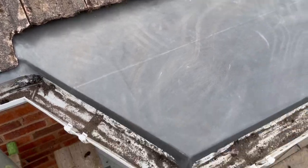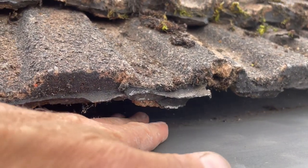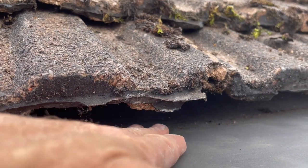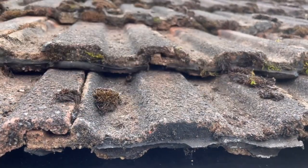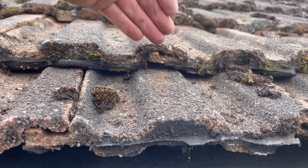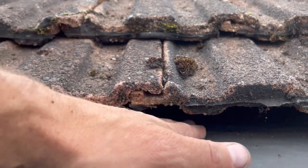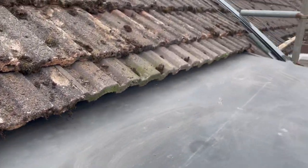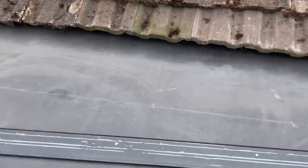The tiles are back in place now. You don't want the tiles touching the rubber — you don't want any pressure on it, because it could potentially damage it. That's why I've put a batten up here; the tile is resting on the batten so it's hooked over and kept away from the rubber, so there's no weight or pressure bearing down on it over time. The last thing to do now is to put the finish drip edge on — I'll miter it on the corners.